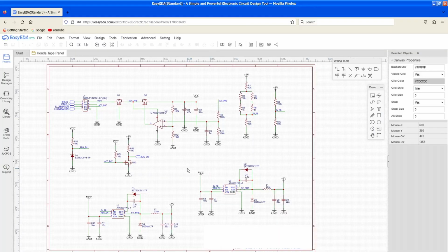Here's a schematic of my circuit. Or this is the final circuit, obviously, but it's more or less the same as what I had in the breadboard. So we're going to have a single connector that the front panel will plug into. And what's really cool about this tape deck is it has two different connectors for IEBus and audio, so I can just plug one of them into the car and plug the other into this front panel, which is essentially like a little remote control for it.